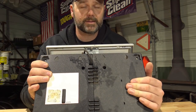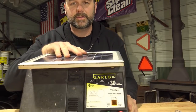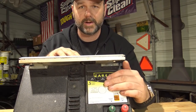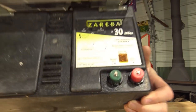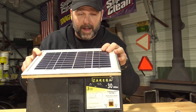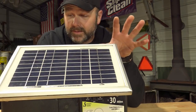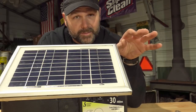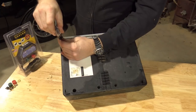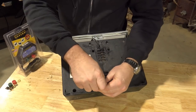Back here are two panels. This panel comes off and has batteries in it. This panel right here comes off and has a circuit board and controller. The circuit board and controller translates to the front where you have your two leads and your little shocker. This one is functioning properly — when you turn it on, it has a summer and winter setting. When you turn it on, you should hear it pop and see a flash. There's a little light bulb and we'll show you that once we get the circuit board out. The T10 Torx is what you use to take it apart — and these aren't machine screws, they're more like a wood screw or a plastic type screw.